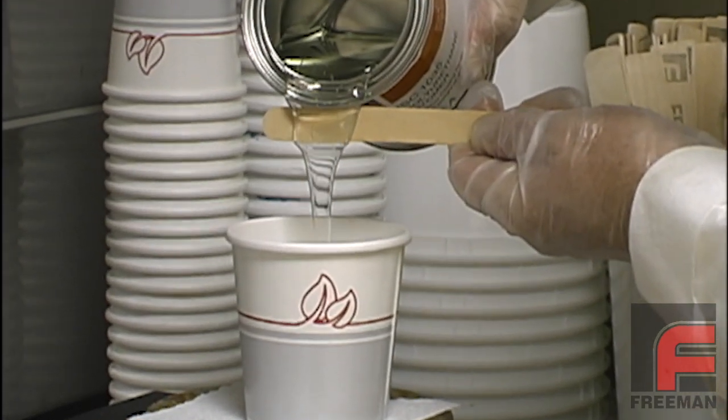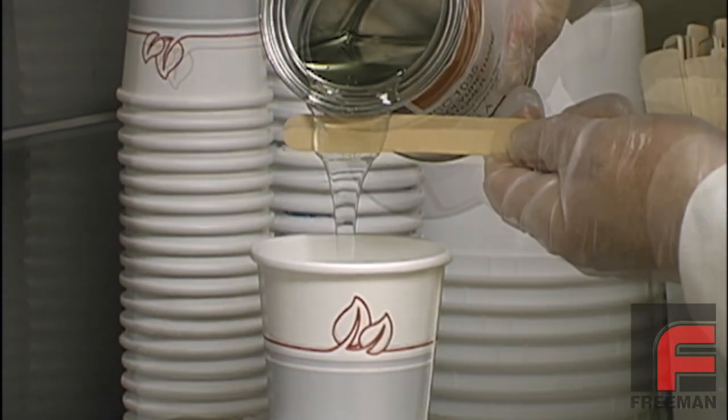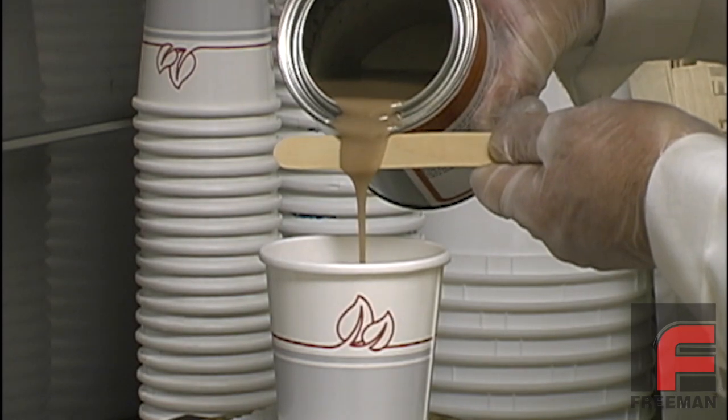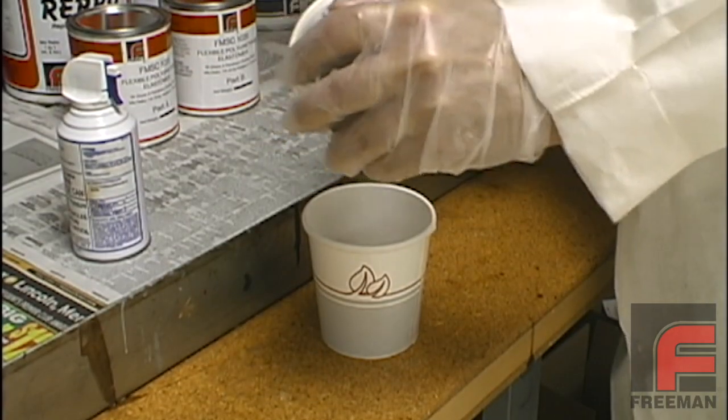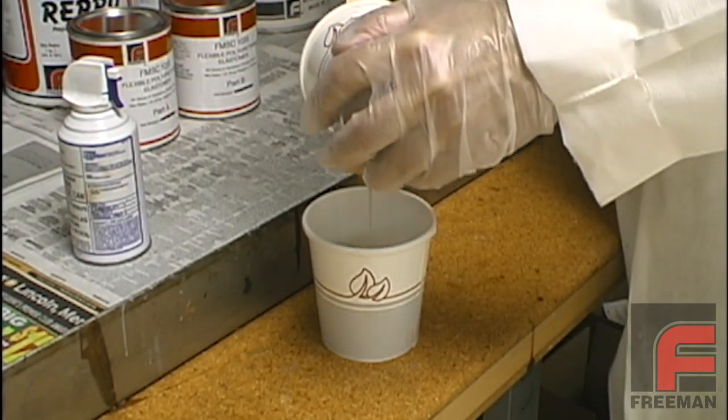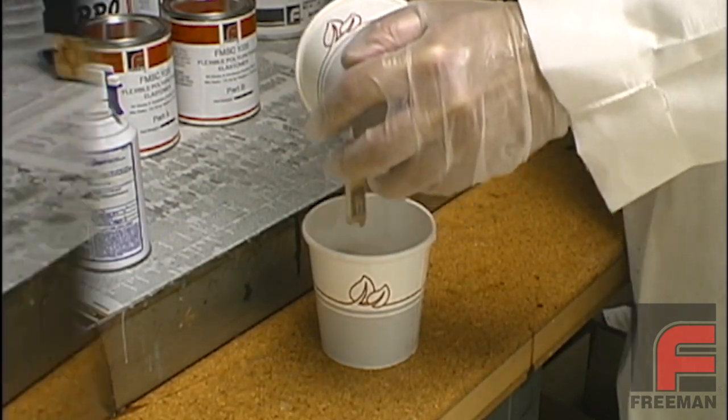In order to guarantee the performance of any tooling plastic, you must weigh and mix the materials properly before using them. Poorly prepared liquid tooling materials is our number two source of tech calls and is usually the cause of materials not performing to their specifications.